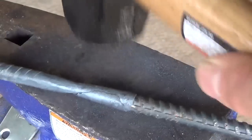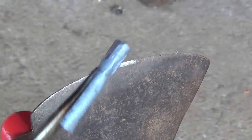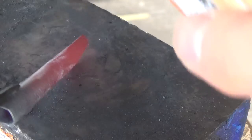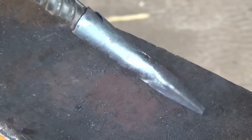Using an axe head as a hot cutter, I cut the point off of the rebar about half an inch from the start of the socket. Now holding the socket with a pair of pliers, I draw the arrowhead out into a four-sided point. After a final fitting onto the point mandrel, I let the point cool down in the air.